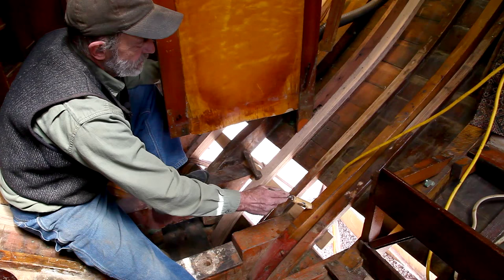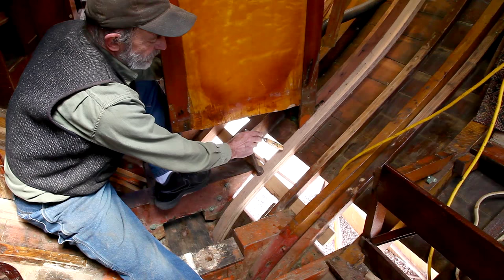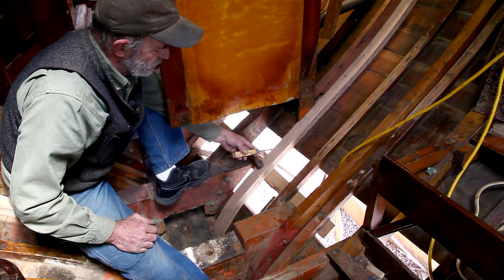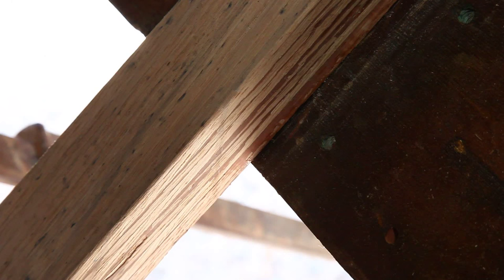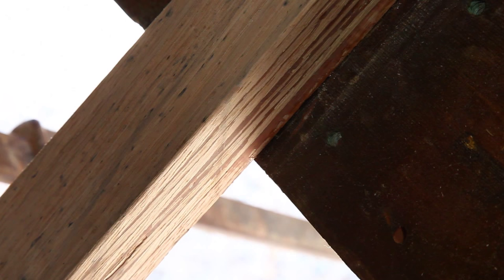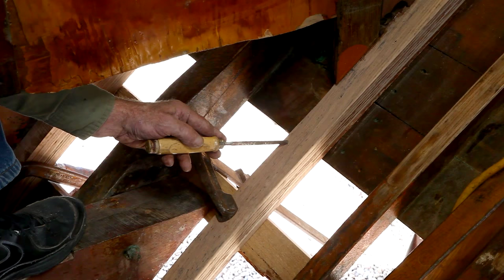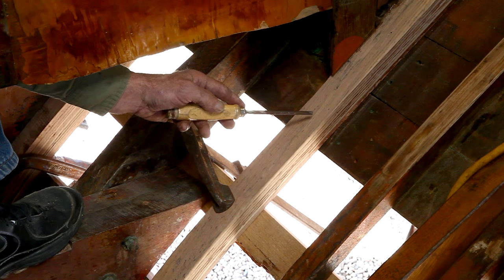Now this is a laminated frame here. This frame has a requirement that the fore and aft faces would be directly athwartships. So that frame is not a rectangle — it's a rhombus. It lays against the plank and also against the bulkhead. It's laminated out of a number of thin layers, approximately an eighth of an inch, and then it has a progressive bevel sawn saddle that it sits on.